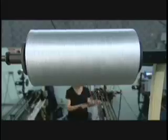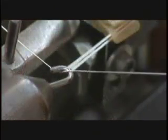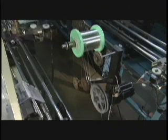Classical guitar strings are made with a stranded nylon core, which creates a warmer tone and softer feel. A worker hooks the nylon core material onto the string winder, then loops a silver-plated copper wrap wire onto the nylon core. The hook spins, coiling the wrap wire around the core, binding it and pulling it down the length of the string.